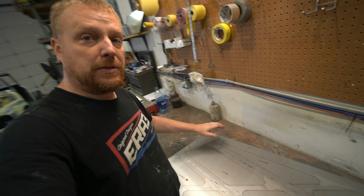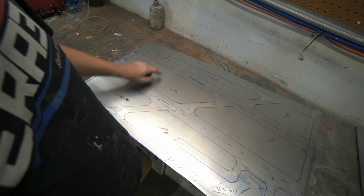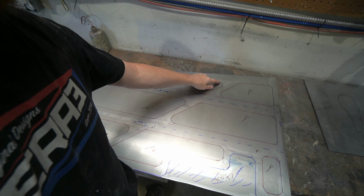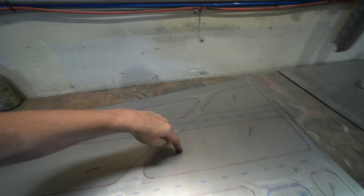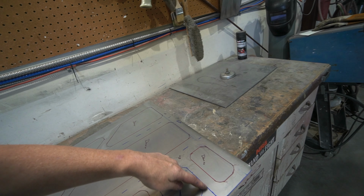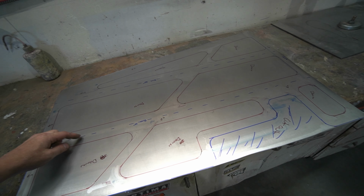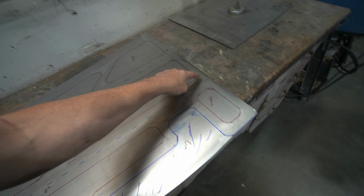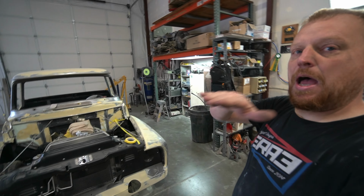So this is going to be the passenger side, and we've got it marked out where we can put it in our bead roller and roll out our bead steps. So we're going to step this down, this down, this down, this down, this down, this down, and this down. This will be cut out for the shock and the upper A-arm, and then this will be broke at 60 degrees, and this will be at 30, which should give us 90 degrees from the top of the wheel well